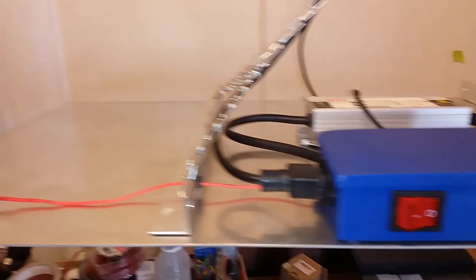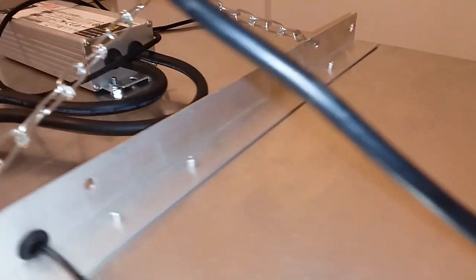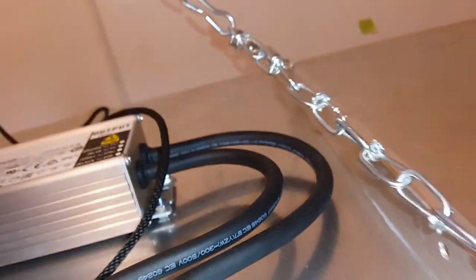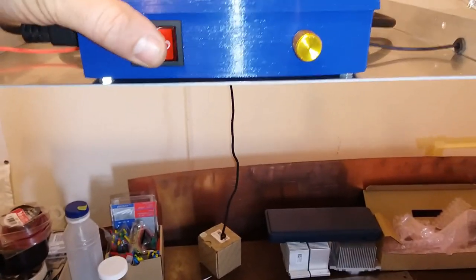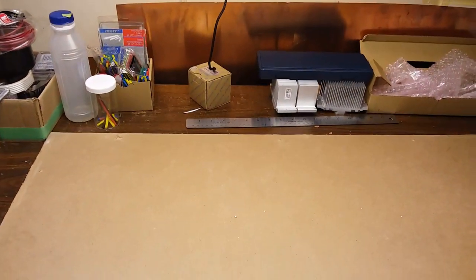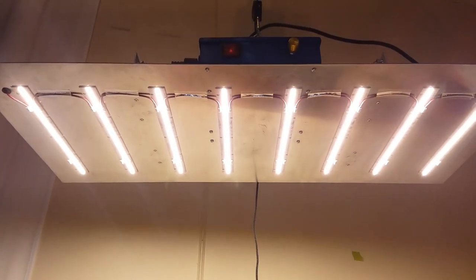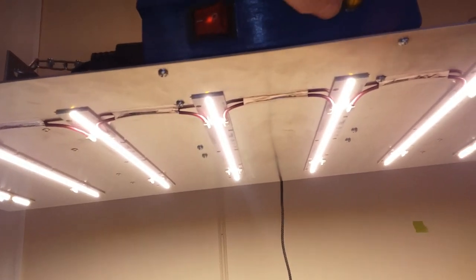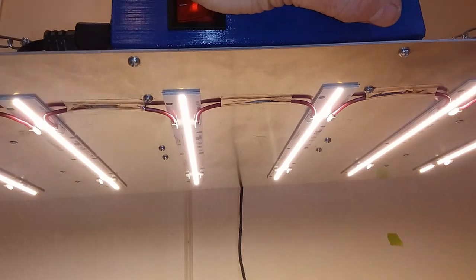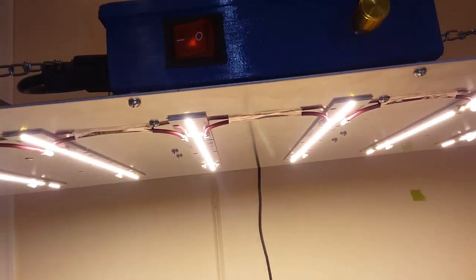So here it is — basically a shelf lamp, with little spots on the side there. There are four mounts that can be easily switched around for the best hanging position. Let's turn this baby on. And there we have it! Eight BridgeLux EB2 strips, ran at 350 milliamps. Runs pretty nice and cool. It's also on a dimmer — we can dim that pretty far down, pretty well all the way to off.